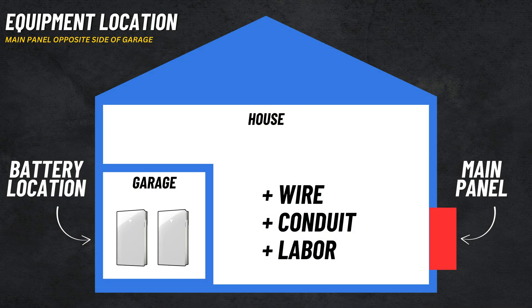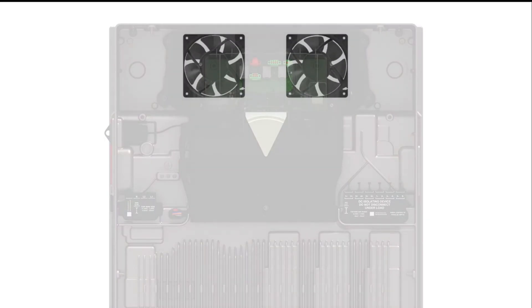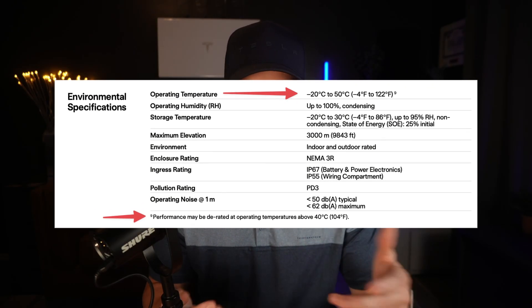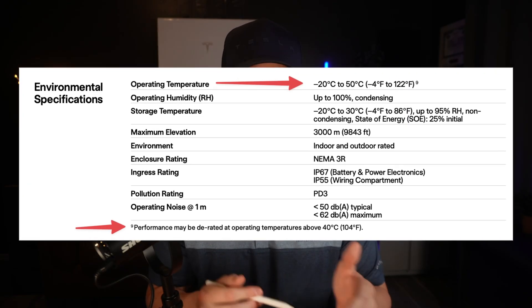You might really want them installed inside the garage, but if your electrical panel is on the opposite side of the home — like mine is — it may still be doable, but it will require more wire, conduit, and labor, which can increase the cost of your project. With that said, outdoor installs are also completely fine. The Powerwall 3 is outdoor rated with a temperature range of up to 122 degrees Fahrenheit. A common follow-up question I get is what happens when it exceeds that temperature, especially here in Arizona. The battery isn't going to shut down — what happens is the system will derate or throttle itself, kind of like a computer or phone that gets too hot and starts working a little slower. The Powerwall might have a slower charge or discharge rate on those really hot days above this threshold.